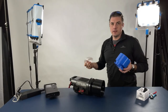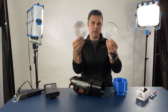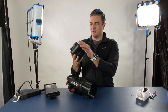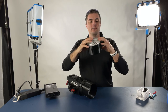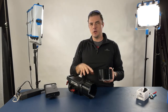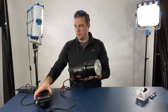Here is one of the first versions of the Fresnel lens — Ryan took it and retooled it, improved it. We have better light projection and finishes on it, so this should give us better projection. Now the proper moment of truth: if I measured this correctly, it'll sit in there. It looks like it did — I just need to make that channel a little bit deeper for more coverage. We're still looking for the correct resin for heat resistance, because with no heat ventilation in the lens itself it's going to build up, and this lens gets a little soft after some time under use.